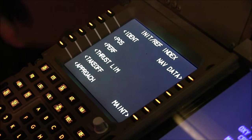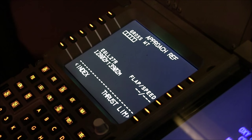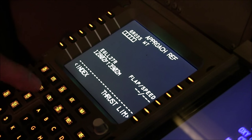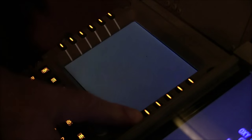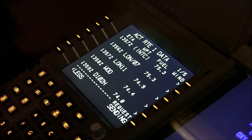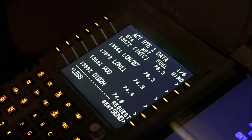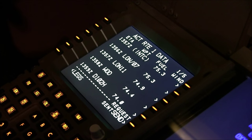Go to the index page and check the approach page — make sure you haven't got a flap speed in there, otherwise it will appear on your PFD for departure. You can also uplink winds having put your route in, by sending the request and waiting for it to come through, then activating it for the appropriate legs. That completes my initial FMC setup.